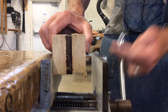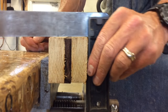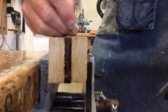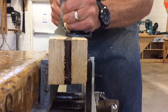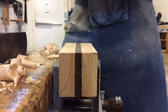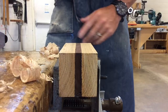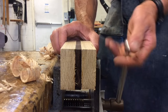Back at the wood bench and into the vise. I'm going to take a square and check how square my block of wood is, marking the high spots with a pencil. Then I'm going to take a hand plane and plane those high spots down — the whole point here is to get the block as square as possible. I check it again, fine-tune it, and come back and finish it up with a block plane, which is a smaller version of the plane.